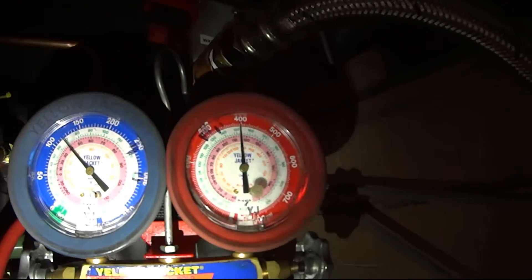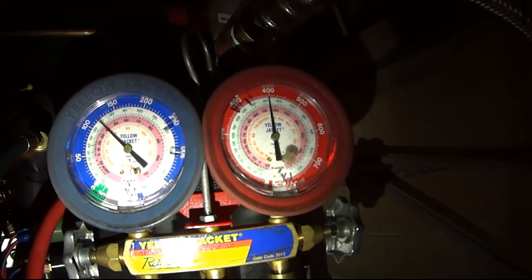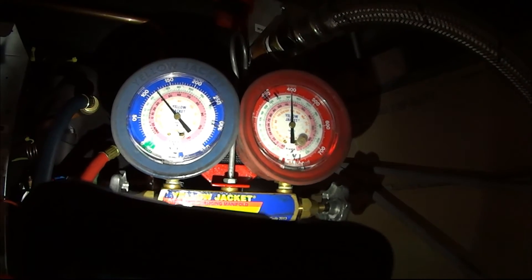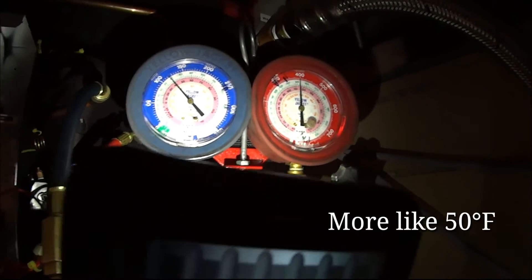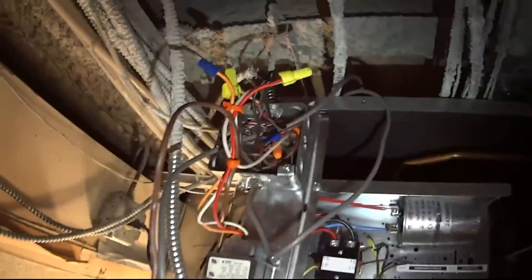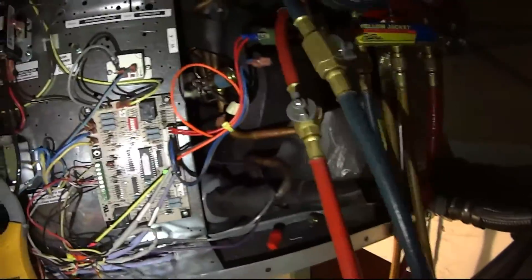This is the exact charge in this unit — 4.6 pounds. And I got 400 head pressure. The water downstairs was at 40 degrees — I just wanted to see the thing come on, I just wanted to make sure everything was alright. So that's our final right there. I'm just going to close up that little box and we're good to go. And that's it.